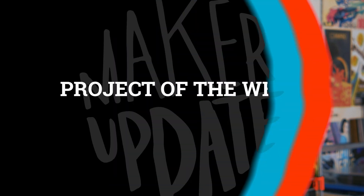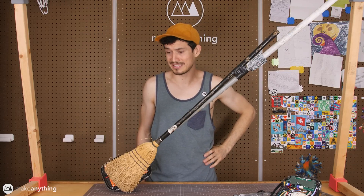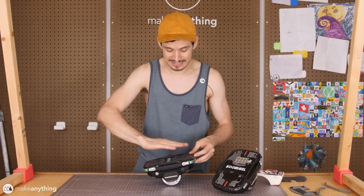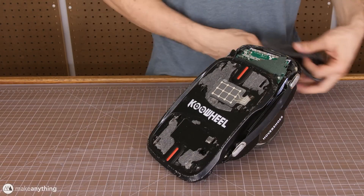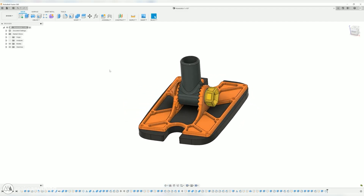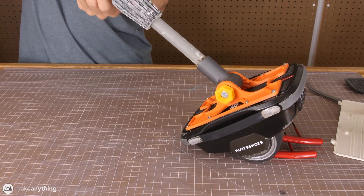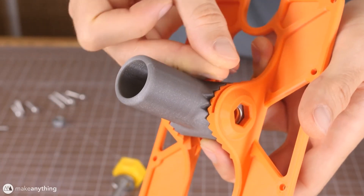I've also been thinking about this week's Project of the Week, which hopefully you can get made before Halloween comes around. On the Make Anything channel, Devin Montez has a video on how he made this motorized witch's broom that can push him around on a skateboard or roller skates. To make this work, he's hacked one of these motor shoes, which were part of the hoverboard fad — basically a hub motor and a battery pack with a tilt sensor that throttles the motor depending on how far you tilt it. To adapt this to run on the end of a broomstick, Devin created a 3D-printed mount. One piece acts as a base plate that screws down where your foot would normally go, then another piece screws on, which allows you to connect the threaded end of a painter's pole and gives you some adjustment over the angle of the stick.